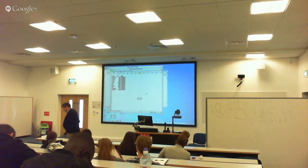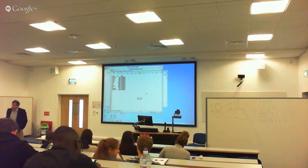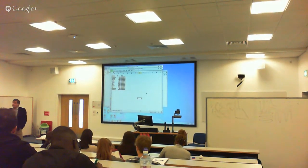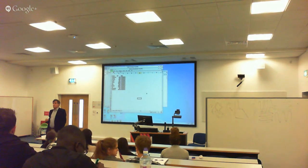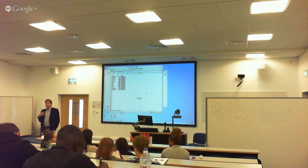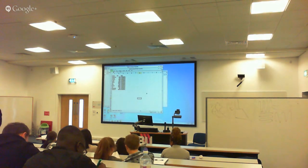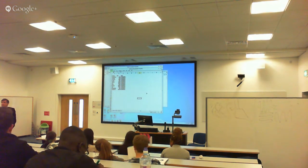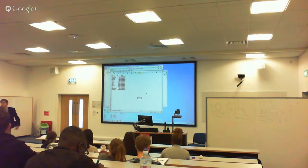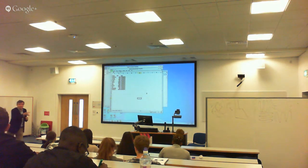Rolling. What is rolling? Rolling again produces a constant cross section. It's mostly used to make plates or strips, but it can also be used to make rods of various shapes, circular rods, hexagonal rods, etc. Rolling and extrusion produce a continuous shape. Forging does not. Extrusion and rolling produce constant cross section, so they're limited. Forging is not limited. But the disadvantage of forging is that it's much slower, therefore a lot more expensive, because you're working with individual pieces.